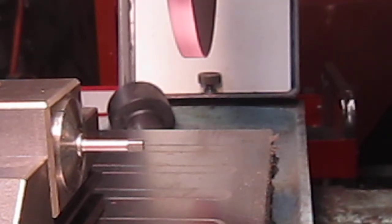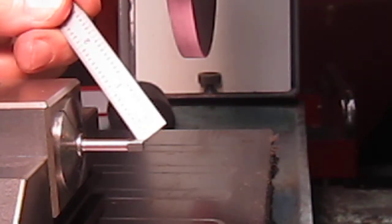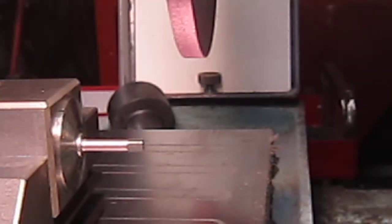Okay, that was the last cut — basically cutting 22 thousandths a side, 22 thousandths a side, and it's a 250 thousandths cut to create the flat. So you'll see how it turns out — that's one step in getting there to making the tool.